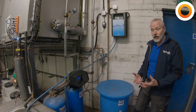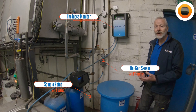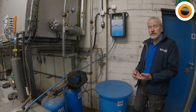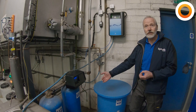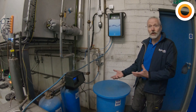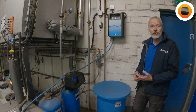If we're going to investigate it, the next step would be to take a sample out of the softener and make sure it is actually producing soft water. The best time to do that — the most likely time when you're going to have hard water — is at the back end of the cycle on a particular resin bed. When you're doing these checks, you need to make sure you're alternating between U1 and U2 so that you get a good idea that both resin beds are actually working equally.